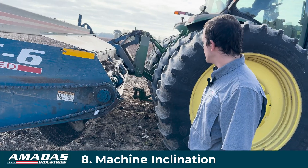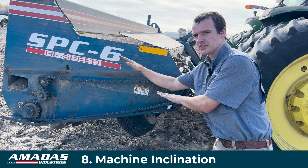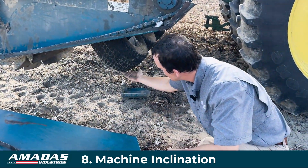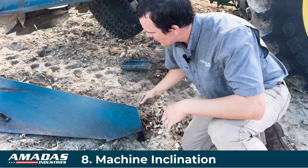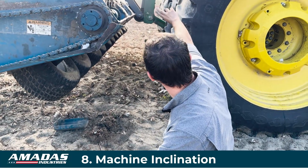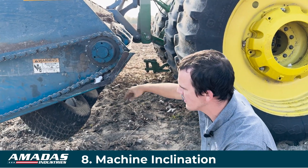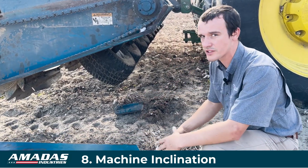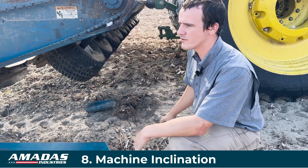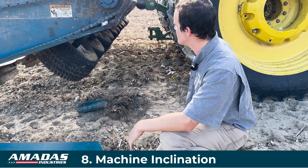You can adjust the inclination of the machine when it's in the ground — whether the machine is tilted a little bit forward or tilted a little bit back basically controls how high these wheels are above the ground. If you're in really short stalks, you'll want to decrease the length of the top link of the three-point hitch; that'll bring the tires a little closer to the ground to really grip the short stalks. If the stalks are longer, you'd be okay with a longer length in the three-point hitch.